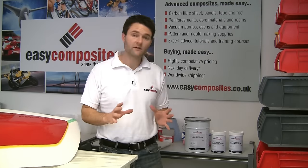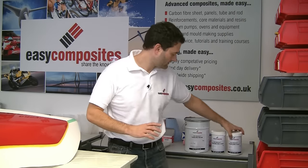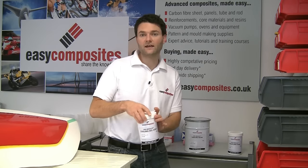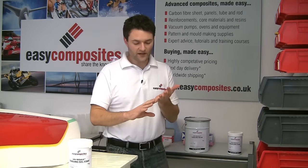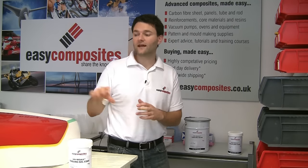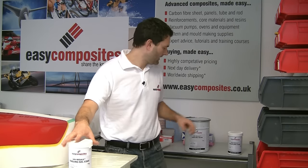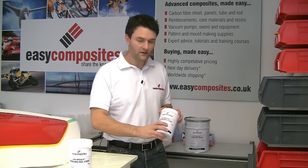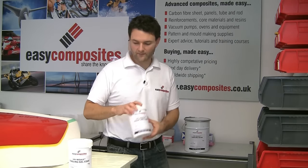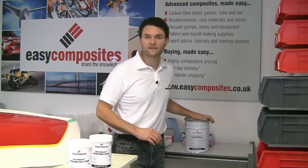So we're going to be using a very versatile tooling system called Unimould, and the Unimould system comprises a tooling gel coat, which is a vinyl ester tooling gel coat. Now the reason we're using vinyl ester is that it's actually compatible with polyester resin, vinyl ester resin, but most importantly for us, epoxy resin, and it'll guarantee an excellent release of the parts out of the mould, which you wouldn't get with a normal polyester gel coat. The Unimould system then uses a coupling coat, which is a reinforced coupling coat. We actually add a lightweight chop strand mat in with that, which forms the connection between the tooling gel and then the tooling resin itself.